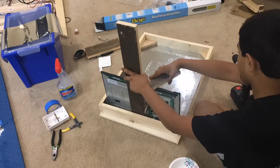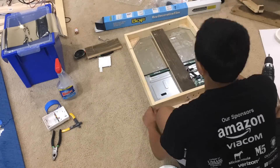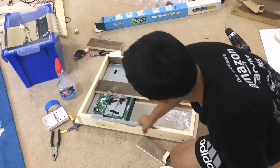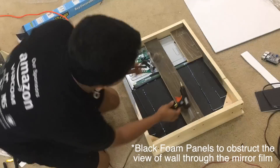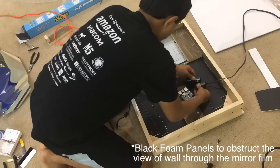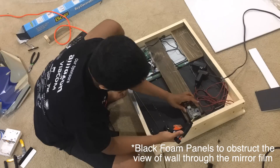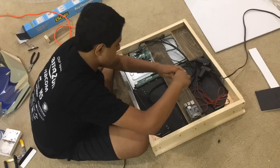I then made a small monitor mount using some leftover pieces of pine 1x4s and some hot glue. I used the VESA mounting holes on my monitor to screw it into the pine 1x4, using drywall screws to put it all together. Next, it was time to mount the foam panels on the back to help keep things in and also to mount the electronics. I mounted a Raspberry Pi and the power cords for the monitor and secured it all up. I drilled a small hole in the frame so I could run the wire through with no issues.